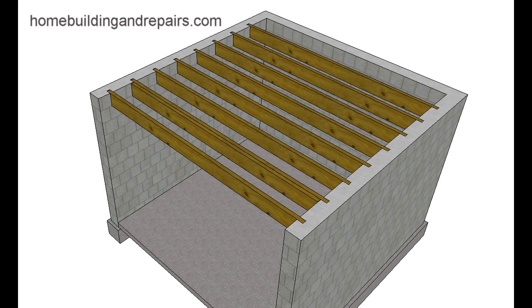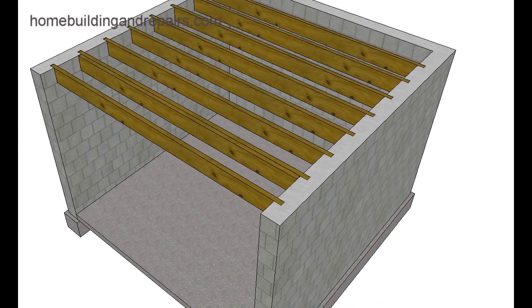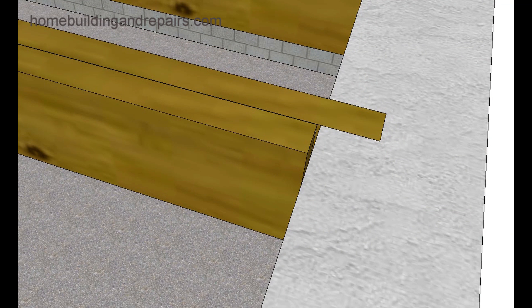The method I would prefer, if the joists aren't damaged too bad, would simply be to attach a new joist to the old joist. This would prevent you from removing the sheathing and shoring everything up. After you add the new joist, that would be a good time to build a new wall underneath both sides of the joist to support them. Rather than using metal or a ledger, just use the walls — but you might need a footing for that also. Make sure the new joist is about an eighth to a quarter of an inch away from the block wall. You might want to notch or cut the joists a little smaller and separate them from the wall to limit moisture transfer.